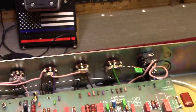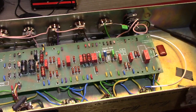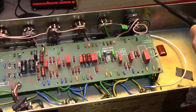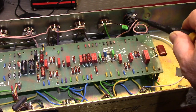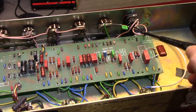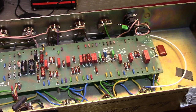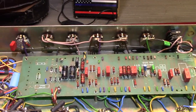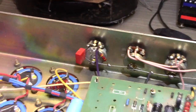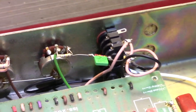Now that's something that should be addressed. A lot of people will tell you that the previous versions of Marshall amps were better — the vertical jack versions. Those are mounted with free-floating wires off the board, going to the tube sockets and wherever they need to go. Same with the potentiometers — you'll notice there are wires running to each one. The presence control has its tone network attached to the pot there. And some people will tell you this design is better than the one it came after, in which Marshall took all of these front components and mounted them directly to the board.